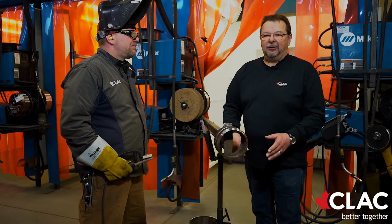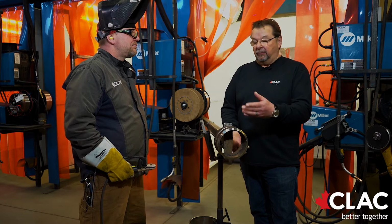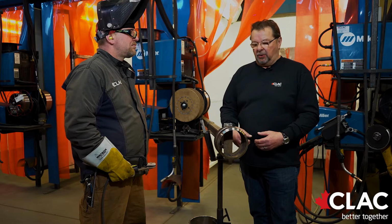At this stage, Kelly's going to start his fill process. What I'd like to point out to everybody is that to complete a welding test, any test, small hot beads is the key to success. Kelly did not use that as a fill pass, he used that as the bonding pass to tie that root into the sidewalls of the pipe.